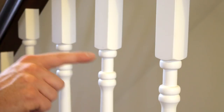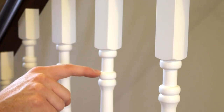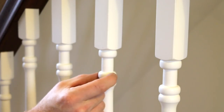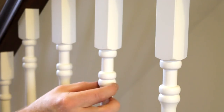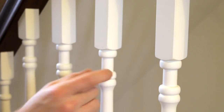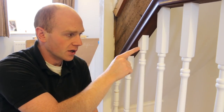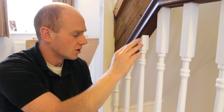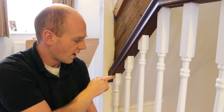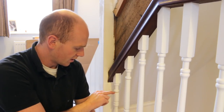On this level, I've decided to cut them just at the bottom of this donut bit here, and that's as wide as it needs to be — if I cut anywhere down the rest of the spindle, it's not going to be wider than here. So I've had to do three of these spindles that get reduced in length. The first one I had enough square stock that I could just cut the mitre as usual. When it got to these two here, this is where I put the join in — so I haven't painted it yet, but there's a join here and a join here. Those are just created with some dowels.